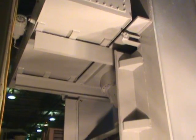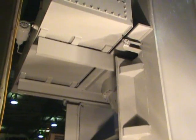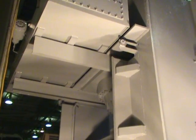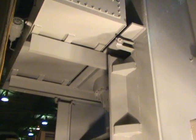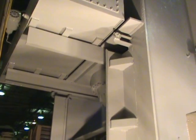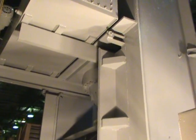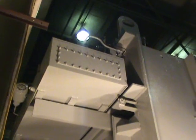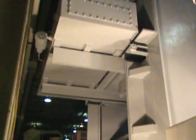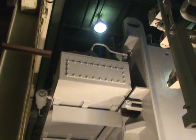This is the back of the press. It has a 30-horsepower motor with Vickers number V435-636 and Dynex number PF4015 piston pump. It's a 165-gallon tank, which is crown-mounted.